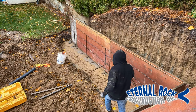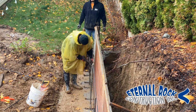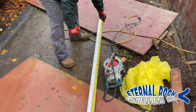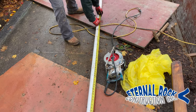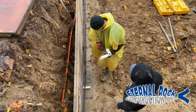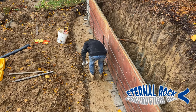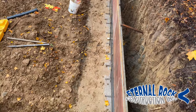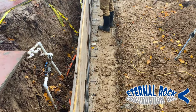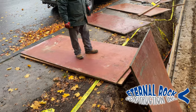You can see that everything is falling into place. We have almost all of the rebar, and right there at that point it kind of turns as an L-shape. The next step is cutting pipe — about a three inch diameter — measured at every six inches thick because that's how wide the wall is gonna be. We cut a bunch of those pipes and we're placing them at the bottom of the retaining wall every eight feet apart or so, because this wall is gonna have weep holes, which helps to drain water from the back part of the wall towards the front for the necessary drainage required.